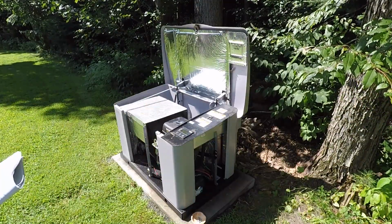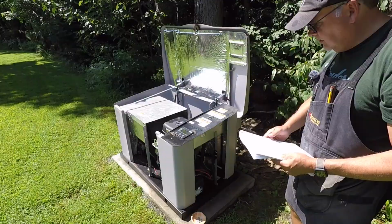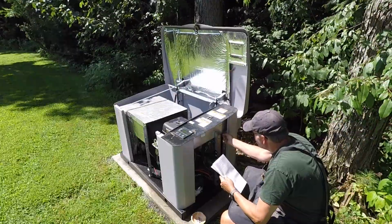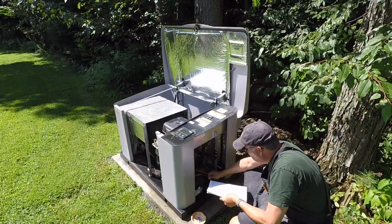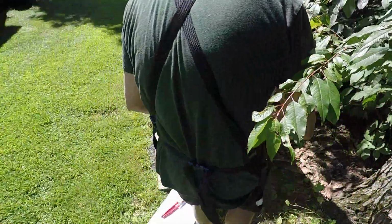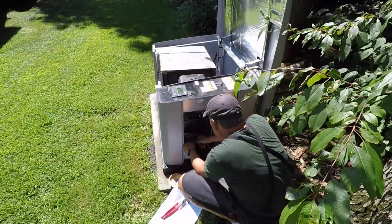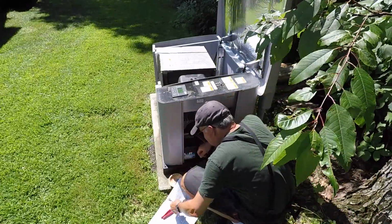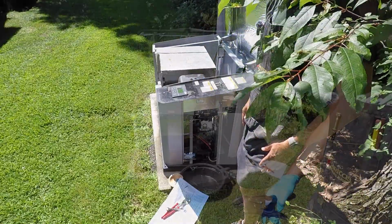All right, step 5 is to remove a 15 amp fuse from the fuse holder. That fuse is right over here. It's a 15 amp fuse. Just pull it out. Let's put it in our bowl and keep it there. And the last thing here is to disconnect the negative wire on the battery. I'm going to do that next. All right, so to disconnect the black wire, I've got a 1/2 inch wrench. There we go. Disconnected, and that's it. Our environment is now safe for our maintenance.